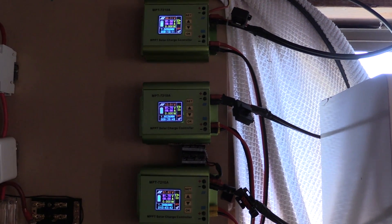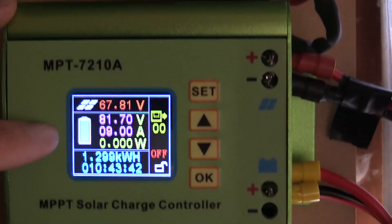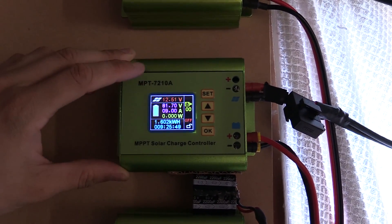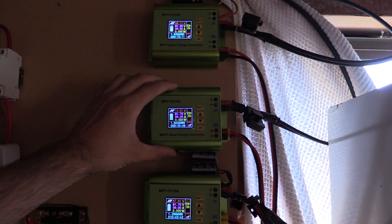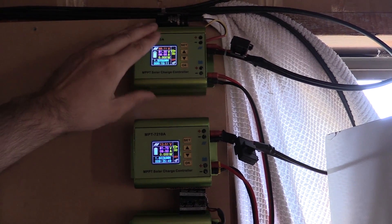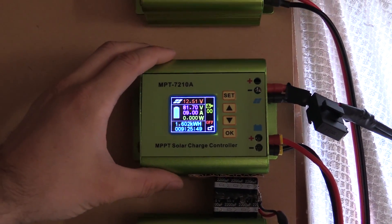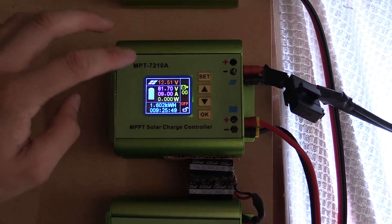This charger here is doing some weird things with its voltage - it's reading 12.51 while the rest are reading 67 and the one at the top is reading 68. The only thing different between this one and the rest is that I haven't changed the input capacitor on this one, which sits up here. These other two units are fine, but this unit is doing something really wacky with its voltage. It still works fine - when I came in the other day it was reading 9 volts but was still putting out 400 watts. So there's nothing wrong with it, it's just reading something really weird.